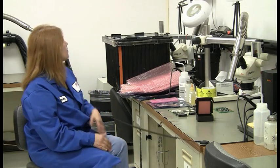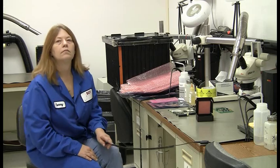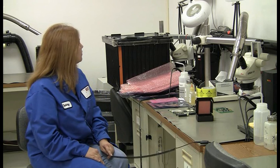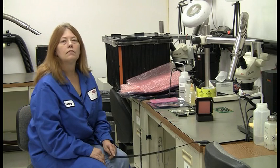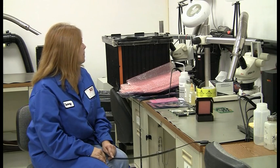The big box behind Tammy is a tote. What we do with this tote is we can transport boards from one working space to another. One thing you've got to remember is when you put a circuit board inside, you want it to fit snugly in there. You don't want it to slide around, because remember, sliding creates static electricity. So you want it to fit tight, and then you can transport it.